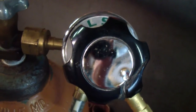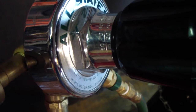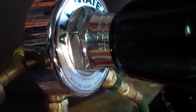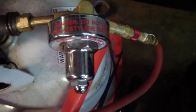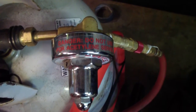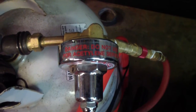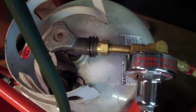As you can see, there are no gauges on it. You go by that side there — I think they call that a micrometer setting. You can adjust the oxygen, but the fuel you can't adjust. There's no adjustment on it. It's low pressure — I think it's like two to four pounds is all it will send through. And when it demands more, it will actually siphon it from the oxygen side and mix it, which seems like a pretty good system so far.